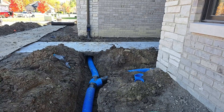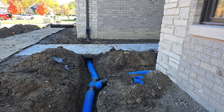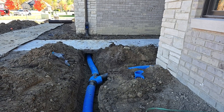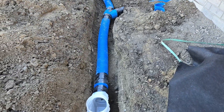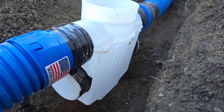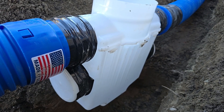This is something that's really common. You have two downspouts, and you're going to have some boxwood hedges, some yew hedges, some really nice landscape. And you're trying to come up with a place to put the catch basin. By the time you get out to where you can put a catch basin, you're on two downspouts. What do you do when you have two downspouts and you're going to use one catch basin? You want to use a really deep catch basin that holds a lot of shingle gravel.